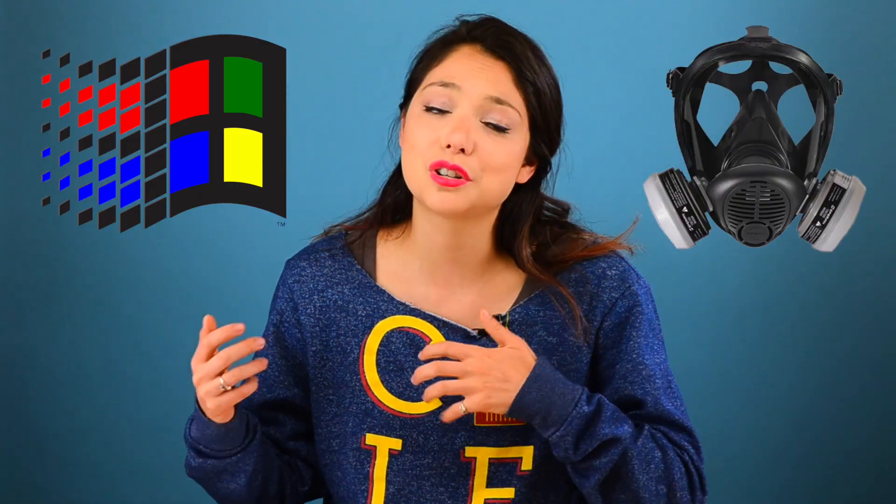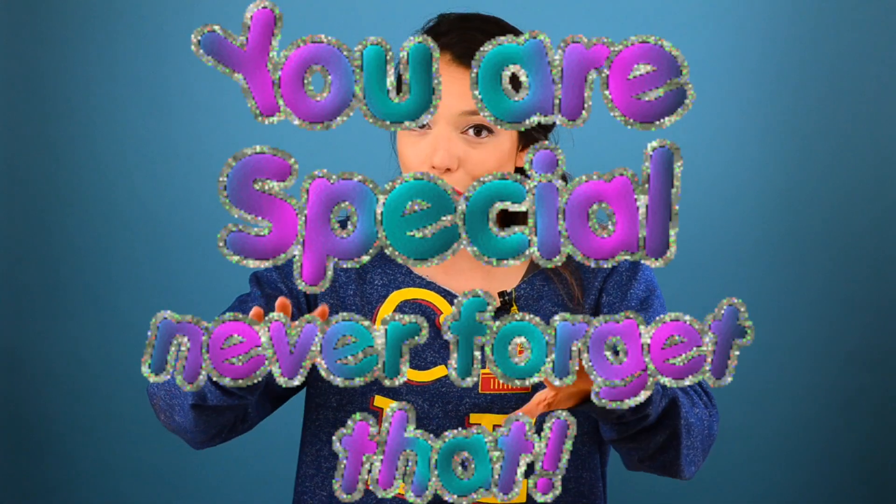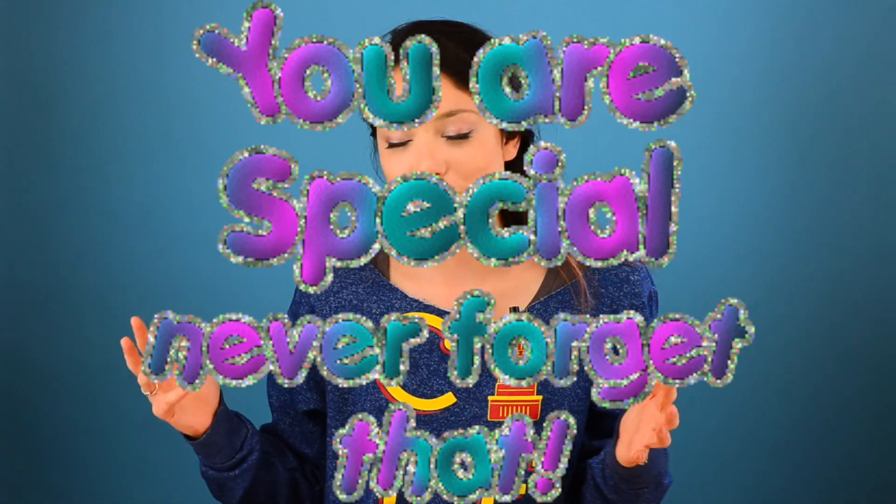I do want to say that if you do end up getting this exothermic reaction, it will let off a huge amount of fumes and you will cough — it is horrible for your body. Make sure you have windows to open and a respirator, and if you don't have that, just leave the room, because you are more valuable than the table or whatever you're trying to make with epoxy. So make sure to take care of your lungs and wear a respirator.